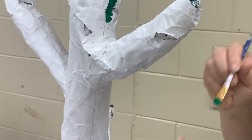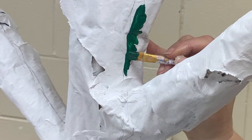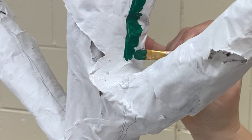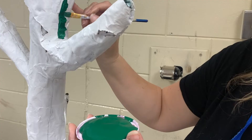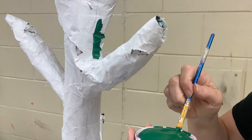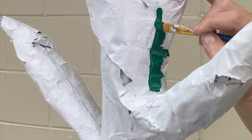Start behind the line again — get a little extra off if there's too much. Curve up and then pull the extra paint back. It's not going to look super even right now — you can see there's light and dark spots — but the next coat will make it look more even. Start back a little bit, work your way up, and make sure you don't have too much paint.